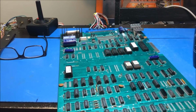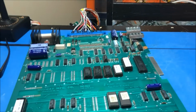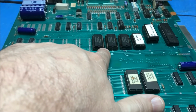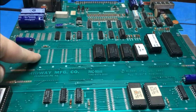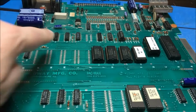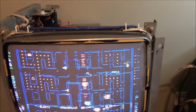And guys, I just wanted to clarify why I could put the Fluke on and get to my ROMs good and verify all my ROMs, but I couldn't get any further than that. The address bit 7 trace made it to this ROM. It's pin 1, but on the opposite side of this pad, where it goes this way, down the line to these buffers, is where it was broken, right under this. It made it to there, but it did not advance from there. So I was able to do all of the ROMs, but I couldn't go beyond the ROMs. So yeah, this is what we're doing.